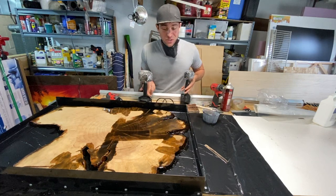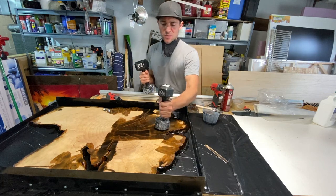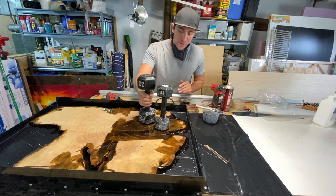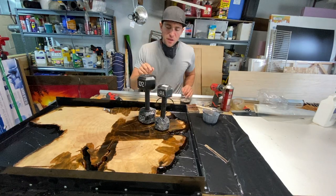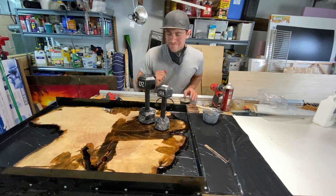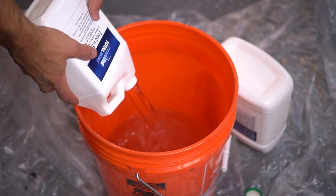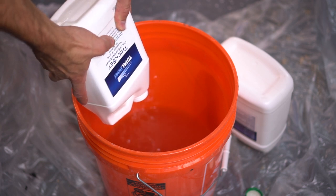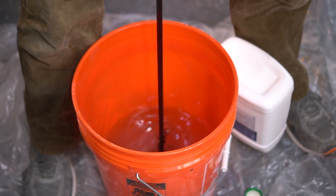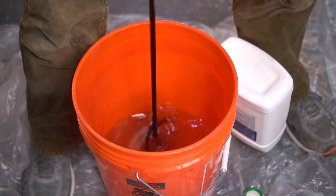Since we actually did crack this slab, I'm putting a little bit of weight on a couple of these pieces just so I know they're going to stay in position during the curing process. Note to self: put some tape on there at the bottom so they don't stick to the slab afterwards. I mix the thick set epoxy in a large bucket since this is a very large amount, and we're going to do the same process - mixing first, then applying our pigment and ensuring proper mix throughout the entire batch.